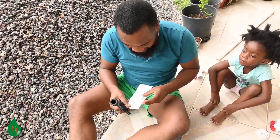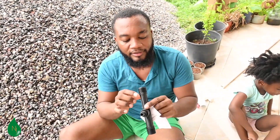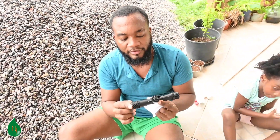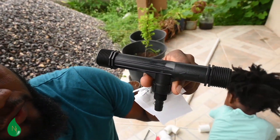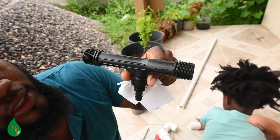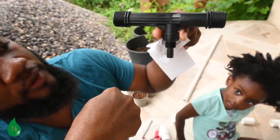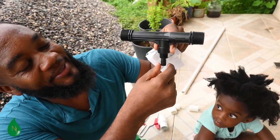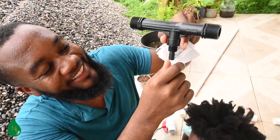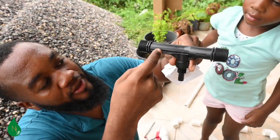It's on the receipt — it's called a venturi. So this is a half-inch or one-inch venturi, and there's a direction on it. This direction will tell you the direction of the water flow. If the source is coming in that way, it will come up through the system, pass through here and down, and then it will — it does suck — it will suck the dissolved fertilizer through this piece right here and continue through the system.